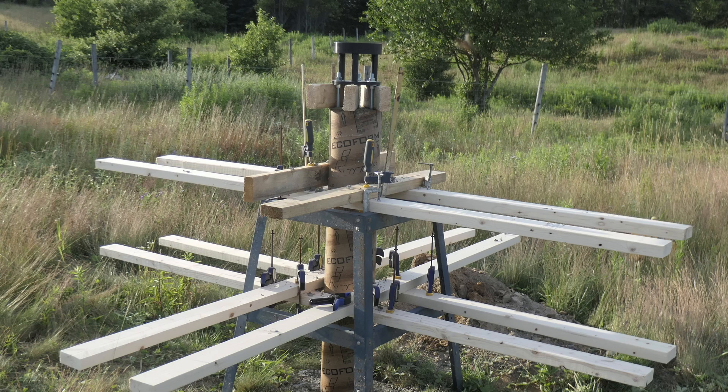When that was in place, I set the pier adapter on top, let the concrete harden, then removed the pier adapter and painted the zinc-plated bolts and washers with Rust-Oleum rust paint. I took the nuts that locked the pier adapter into place, filled the centers with wax, and painted the outside also with the rust paint. Now both the concrete of the pier and the rust paints are finishing their curing, and should be ready to use within a few days.